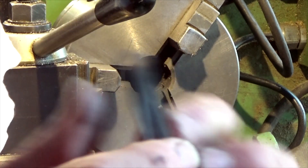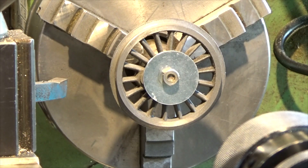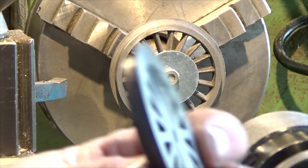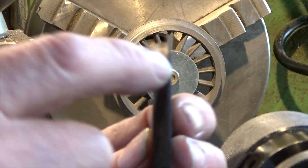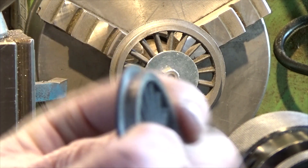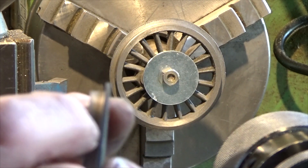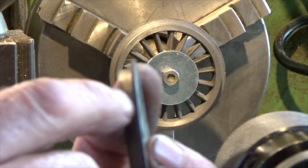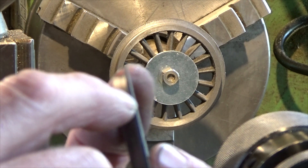They've all been machined now — all the wheels. As mentioned before, what we've got to do now is just get this flange right relative to this cone, just check my dimensions and this depth needs to be 79 thou.